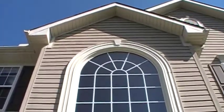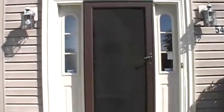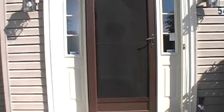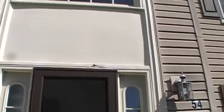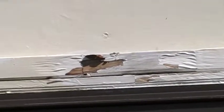We're going to seal the entire top, then top coat the whole thing, caulk everything that needs to be caulked, and then paint it. That'll work out real nice, and hopefully over time it'll dry out inside. It may still rot a little bit. Primarily when you see these doors, it's either up top where it's rotting away — right now it's more peely than rotted. We're going to get up there, poke around, remove anything that's rotted, put new wood putty in there, caulk it, prime it, and paint it.